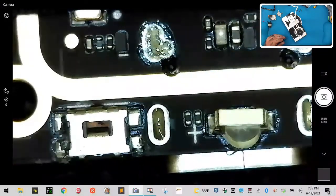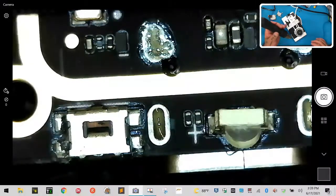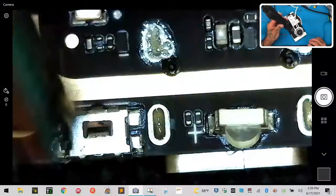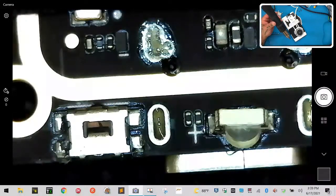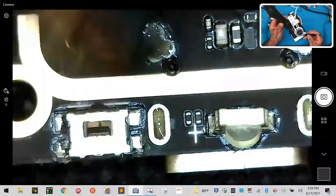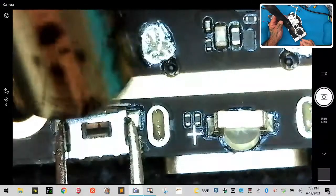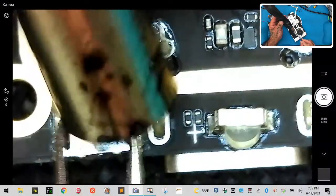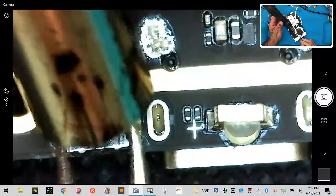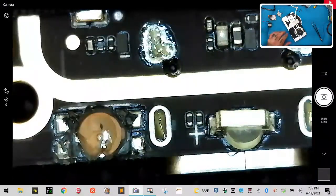Alright, soldering iron's ready, sorry guys. Let me just get this tip cleaned up and see if I can heat this up enough without the heat gun. I do not want to use the heat gun here because there are too many other small components, but if I cannot force this out by heating it up like this then I may have no choice. Alright - heat gun it is. Let me go ahead and turn that on - I just have to be very, very careful to aim it only here and cook this as quickly as we can, especially since this is under the microscope. There we go - perfect, we got the cover off.